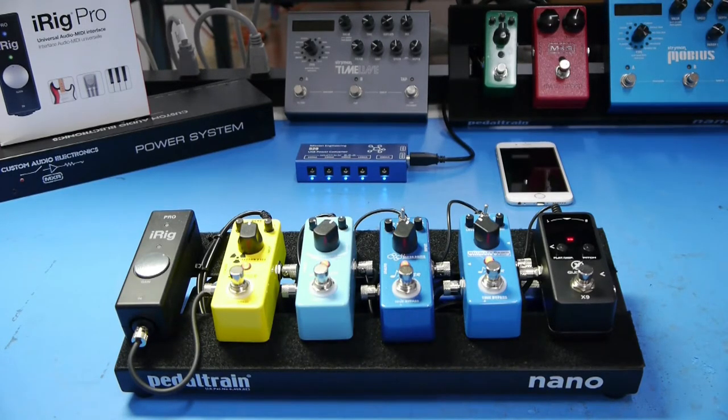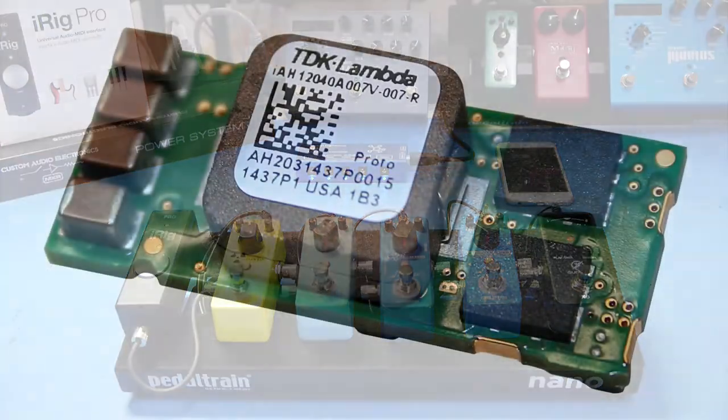Battery voltage is determined by its chemistry. For example, 1.5 volts from an alkaline cell, 1.2 for nickel, 3.7 for lithium ion, etc. Transformers don't work for DC, so to provide other voltages we use modern integrated circuit based DC to DC converters.